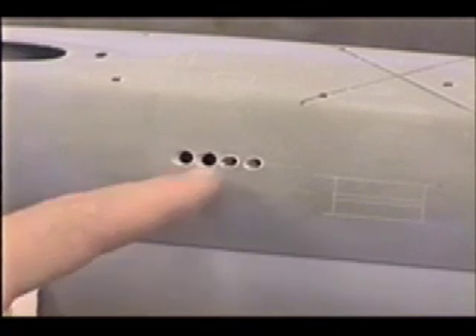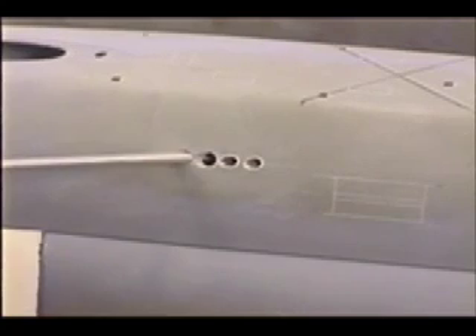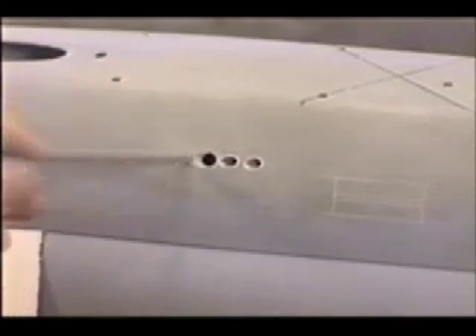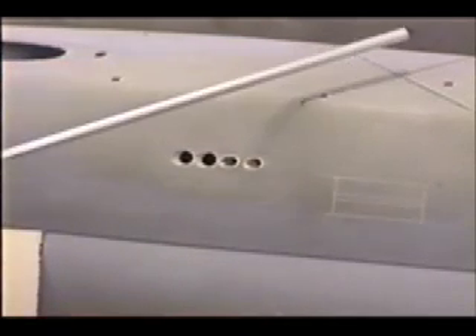The best way to achieve those is to drill your holes and then cam them a little bit so that the tubes you're going to inlay don't project perpendicular to centerline, but at about a 45-degree angle. To help visually cue on that, I've put lines up here which show the angle I want to achieve.